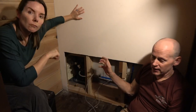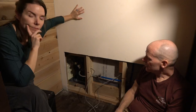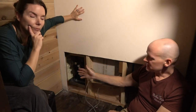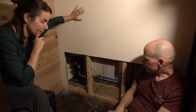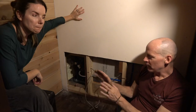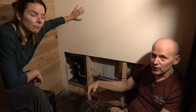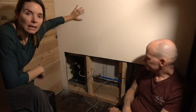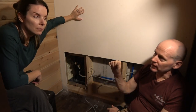The other thing we're doing is, because it's a pretty tight space in there and it's supposed to have a certain amount of clearance all the way around, I'm going to put a low CFM exhaust fan in where the toilet is, down behind by the wall, so you really won't see it very much. When you turn the light on for the shower, that fan will automatically come on and blow air through into the closet. These doors will be a perforated decorative metal, so there'll be plenty of airflow to help cool the generator. It's only going to be running the fan while you're using the steam generator, not constantly. It'll be on anytime you turn the light on for the shower.